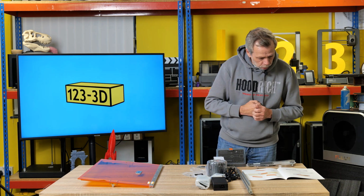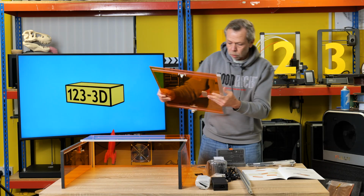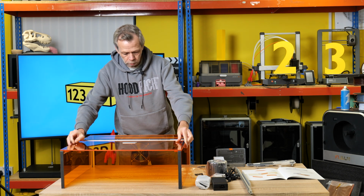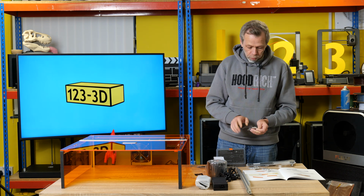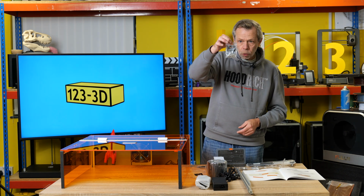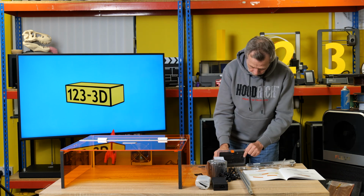Next up, it wants us to get the main part back on the table, and then aluminium to aluminium, and we are then requiring some hinges. Initial impressions, even the hinges are exceptional quality. Then it wants M5 14mm long screws. We're going to need 8. Add a 3mm Allen key.